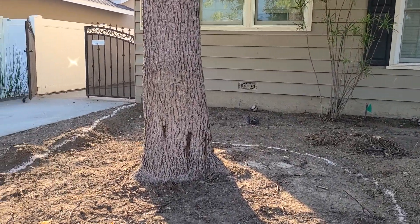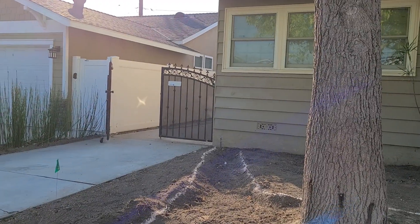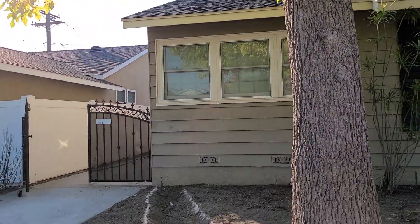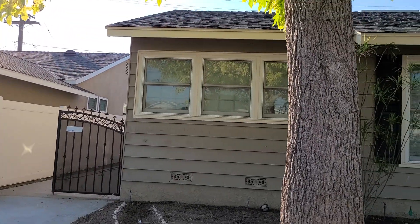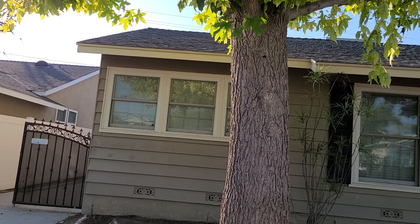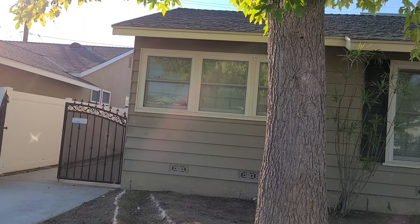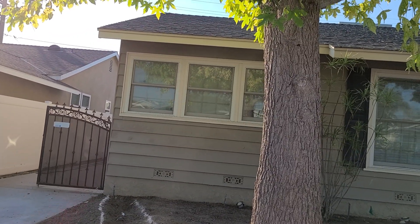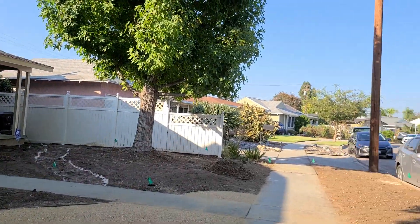Over here you can see we have our line for the dry stream bed. I did the engineering to make sure the water is going to flow towards this left corner of the driveway as the rain gutter comes down. We'll probably have a pop-up emitter inside of the drain — I used that concept on a job in Lake Forest where the drain came down and when the water builds up to a certain height inside the drain pipe, a pop-up emitter comes up and the water flows out. We may run that type of system here: come down two or three feet, then a pop-up emitter to bring the water down towards the front edge of the property.